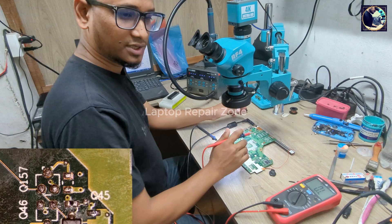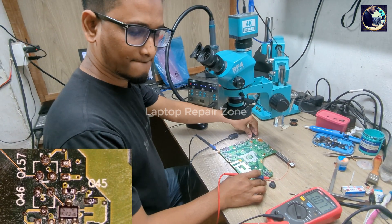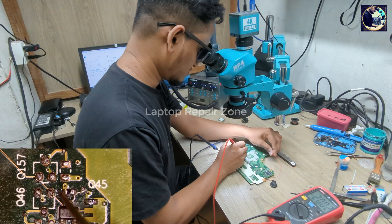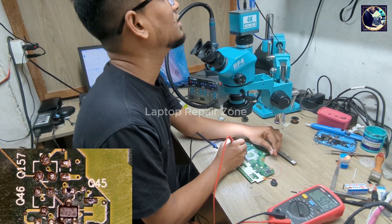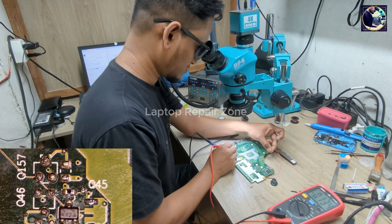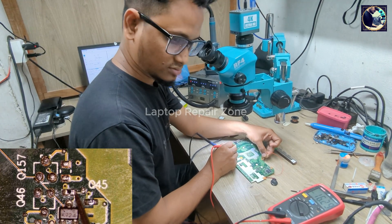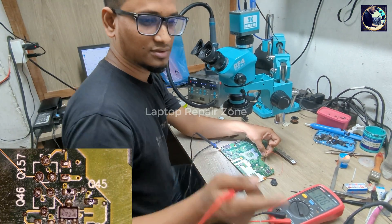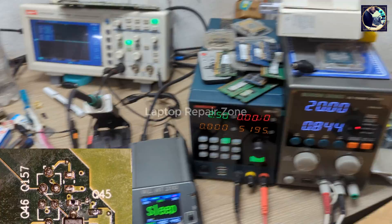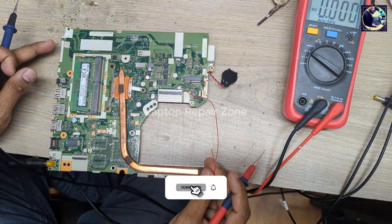I connect my power supply again. First let's check here — we have 20V, other side nothing previously. We have 5V here, working good. Off condition it will be high; after turn on it will be low. Let's turn on — we have 16V now. And as you can see, it's taking almost 800 milliamps and it's not turning off. As you can see, it's still on — that means we have successfully fixed this motherboard.